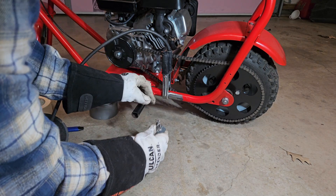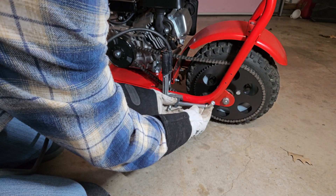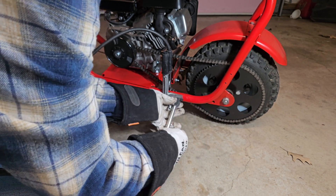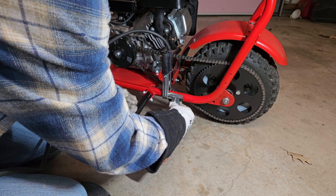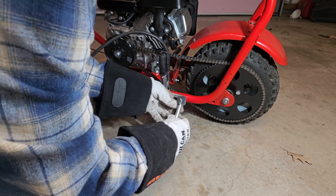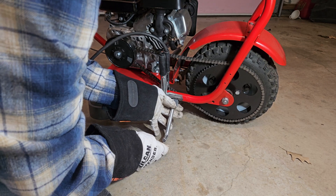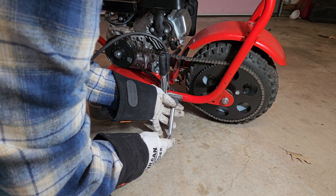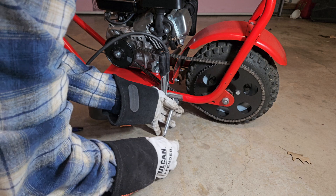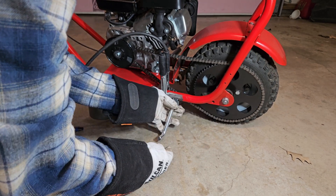When you do this, make sure your ground is on nice clean metal and as close to your weld as you can get it without making it part of the actual weld. We're picking our twist here to make sure it looks nice. We're a little bit above the ground, but we're not leaning very far — we want our lean to be a little bit bigger than this. But we're going to put two tacks on, make sure we like how it looks, and then we're going to weld it.